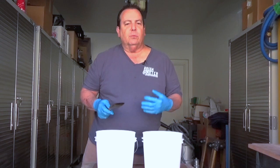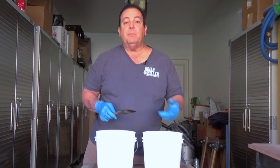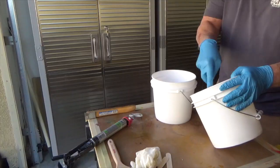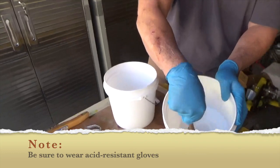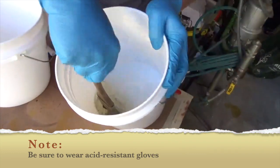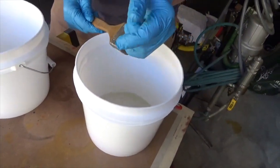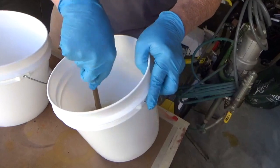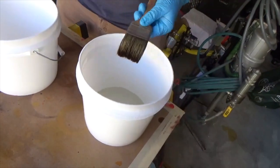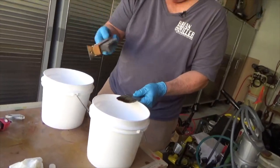whereas if it started to dry, if it's really warm weather, the paint thinner is not going to redissolve it and soften it up, but the acetone will. So I pour just a small amount, tip the bucket, and actually push this brush. Don't be afraid, really push it down into there and get plenty of that acetone, and then take the bristles like so and squeeze it, and you're getting that acetone back into the heel of the brush where typically everything wants to dry.